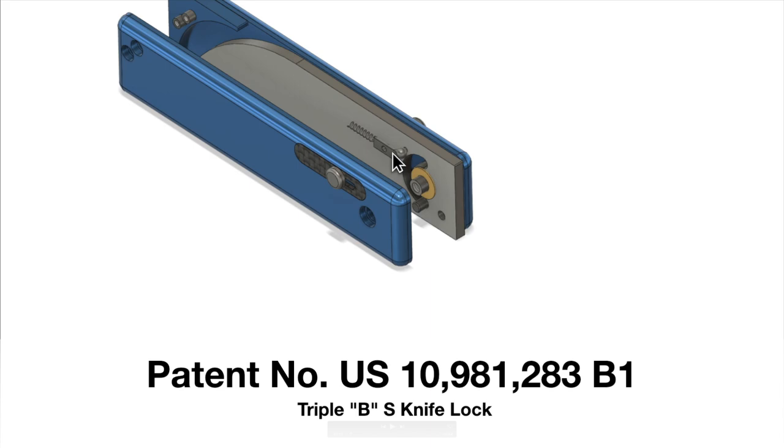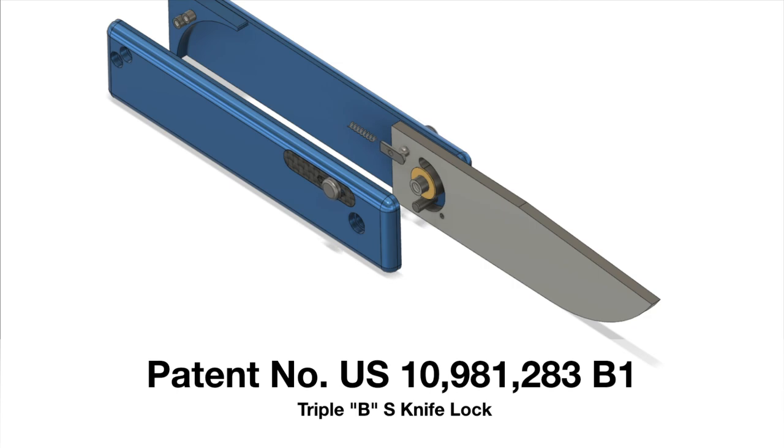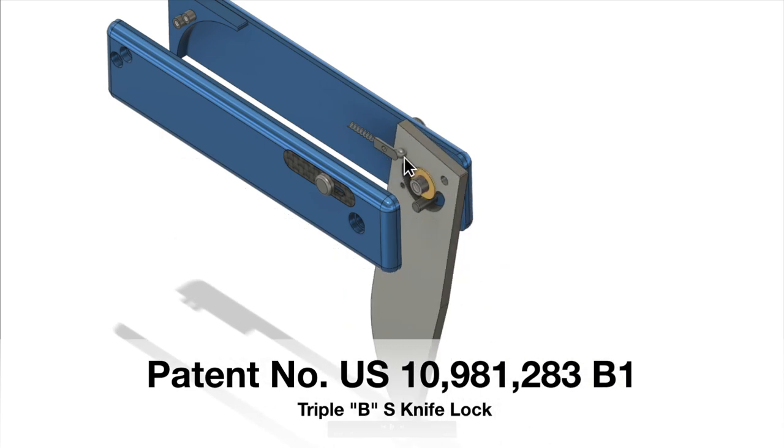The ball-on-ball motion between the ball nose pin and the ball actually allows the blade to push the pin back, overcome the spring detent resistance, and let the blade open — it's a flipper design. You can open the knife without manipulating the thumb studs. Once the blade opens, the ball drops into the larger detent, the pin comes all the way forward locking that ball in place, and the pin gets wedged between the ball and the cover plate.